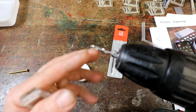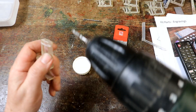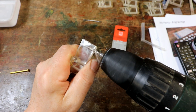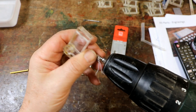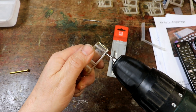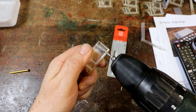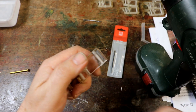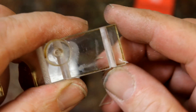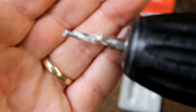Whereas using this, because I've now drilled the holes, this little first part lines up perfectly. I'll dip it in isopropyl alcohol as a lubricant. Then clear the swarf for the first time, because the flutes don't go very far. Dip it in again. That is brilliant - because I've compared cutting the thread both ways, it just cuts beautifully. Best thing though, being that I know it's going to be perpendicular, it's going to be in line with the hole. That is brilliant - I have finally found a use for this drill-and-tap-in-one tool.